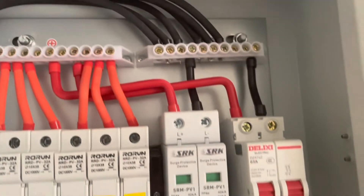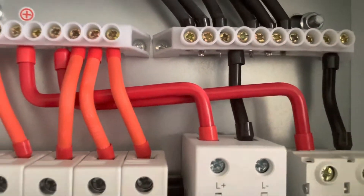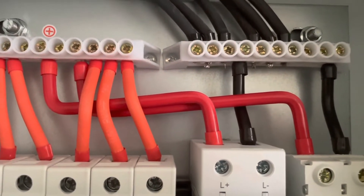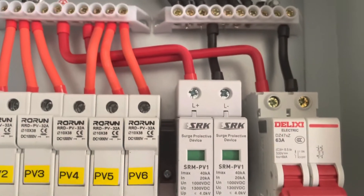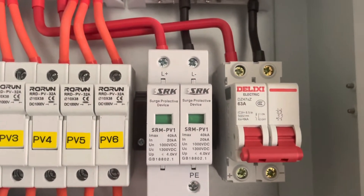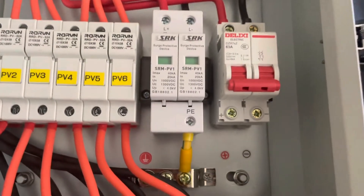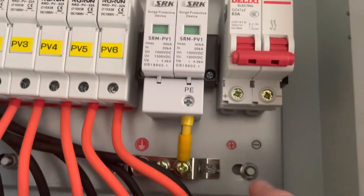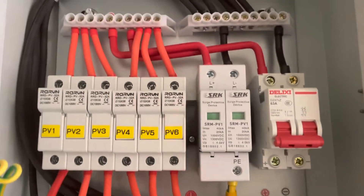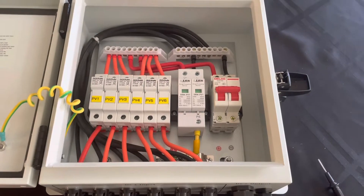A fairly substantial bus bar as far as I can see. The cables running out to the DC breaker are thicker — I think they said they were AWG7. No piggybacking from the SPD this time, unlike the previous one that I had. Out it goes — SPD grounded to the case. Yeah, so it looks like a pretty solid device.